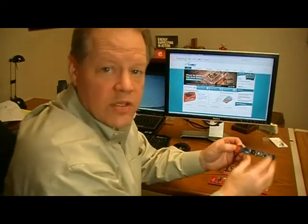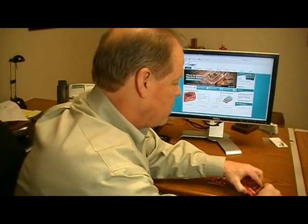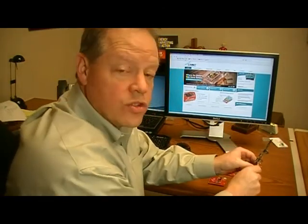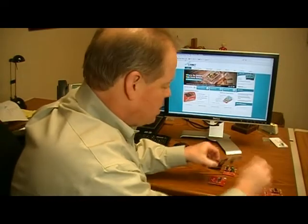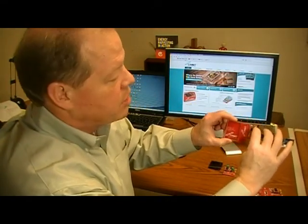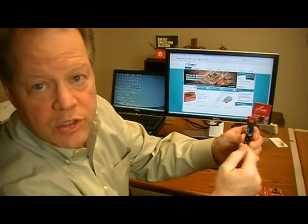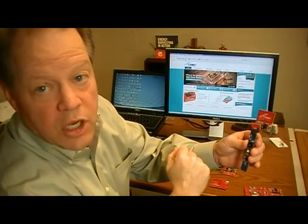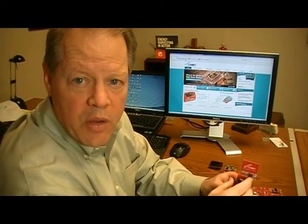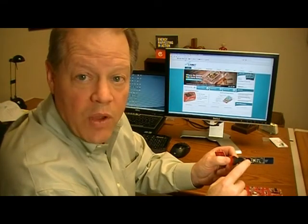Since the connector on the USB stick is universal, it can be connected to the EVAL-9 Universal Energy Harvesting Kit or the EVAL-11, which is the RF Induction Kit. You can use RF induction — this is the charging pad and here's the RF charger. You can use near-field charging to charge up the EnerChip and then power the USB stick off the RF inductively charged EnerChip. There are lots of different ways to experiment with energy harvesting and wireless power charging along with the Silicon Labs RF to USB radio stick. We look forward to talking about your project soon. Thanks for watching.